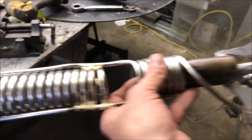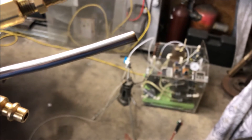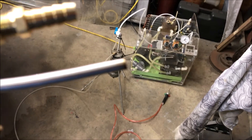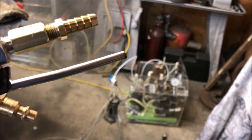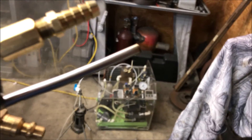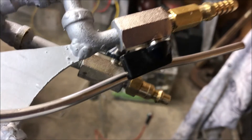One other tip when it comes to working with stainless steel tubing: never use a tubing cutter in the flaring process of stainless steel tubing. They say it work-hardens the metal and causes an inferior double flare, whether you're doing double flare work or even just a regular flare. That's a tidbit from an expert — not me — so you can trust its validity.